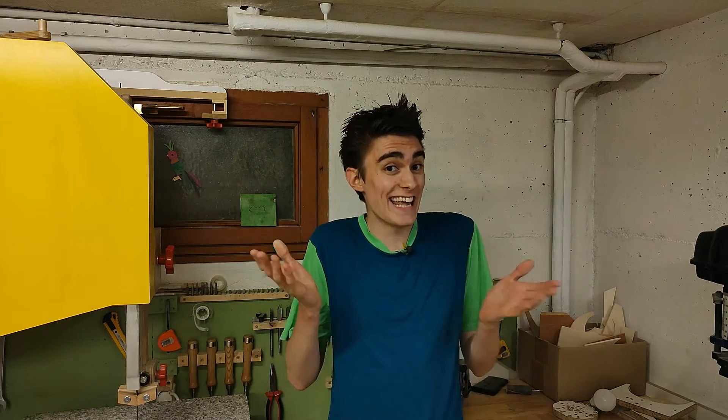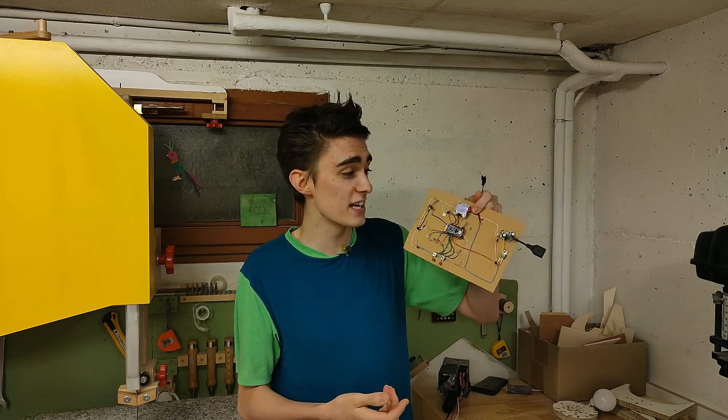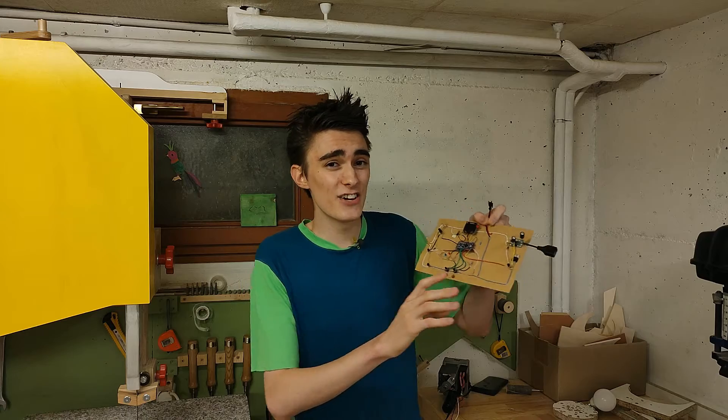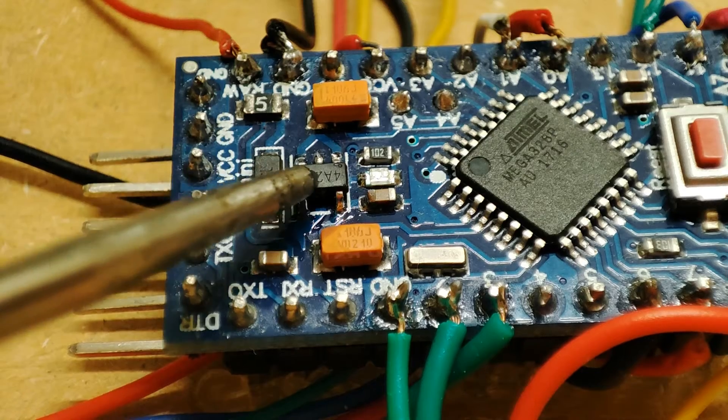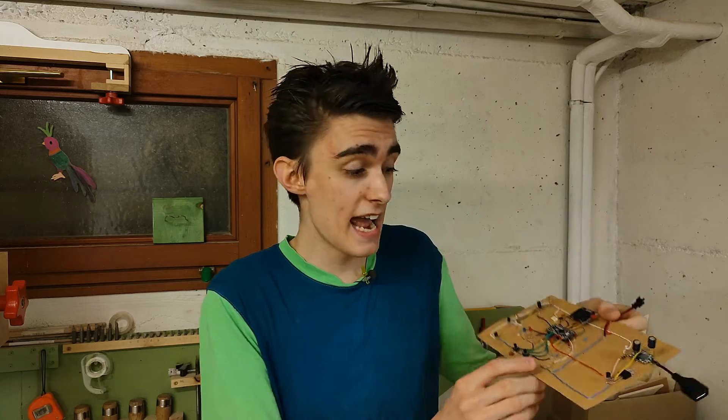Sorry, I couldn't get through the door because it's not yet working. One week to get it done was incredibly optimistic. Actually, I've spent four days trying to figure it out, with the only results being that first I had to rig up an entire prototype of the circuit on this piece of cardboard, because the connections on the breadboard were so incredibly bad it wouldn't even give me remotely similar voltage readings on a constant voltage. Then I managed to blow up the voltage regulator on the Arduino — that's this little guy here — and the original shunt resistor. And now I'm pretty much stuck because the code doesn't work, and apparently the circuit I've been using all this time isn't functional either.